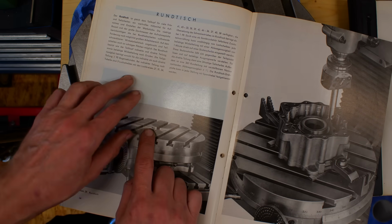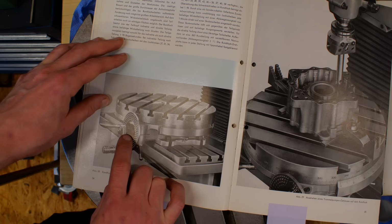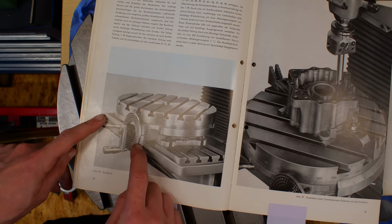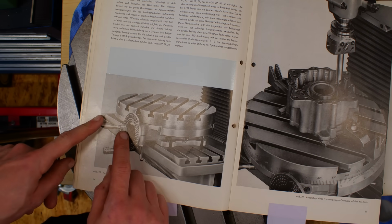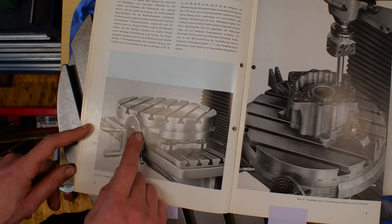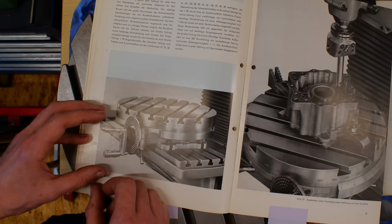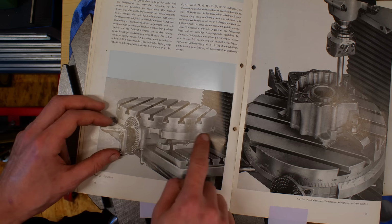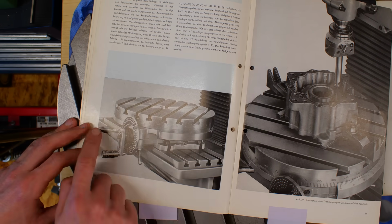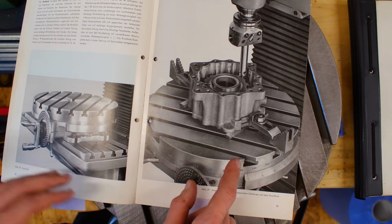So that's the rotary table. It has provision for dividing discs or indexing discs. It has direct indexing too, so you can disengage the worm, and you have 24 positions for direct indexing. There is also the option to remove this whole assembly and put on a graduated wheel and a vernier. You have also a vernier in arc minute reading that's adjustable for 0, and a lock to lock the rotary table down.